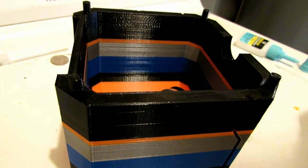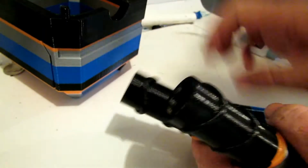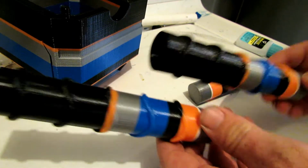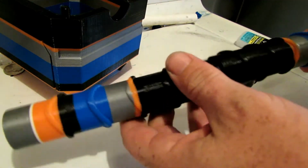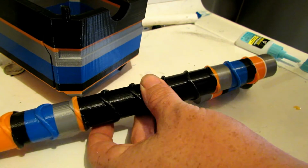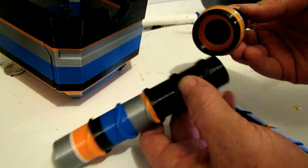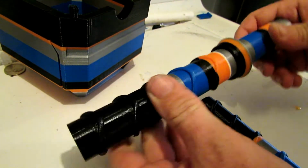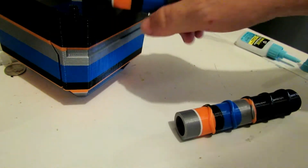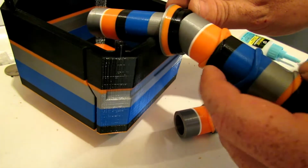Okay, so I only have the first half printed at the moment, so the other part's on the printer. Since my printer is an Anycubic i3 Mega, on this particular print, the handle right here is one long handle. I had to take it into Meshmixer and split it into two pieces to get it to fit onto my Anycubic. All these other pieces fit really good. This has a little lip inside of it that goes on that side, and the other one goes around the base, the little pommel, and this fits perfectly right in like that.